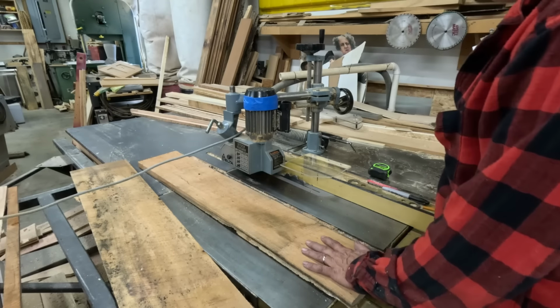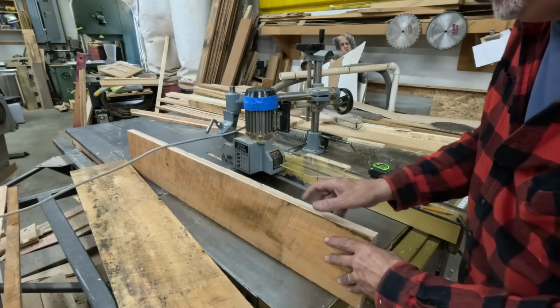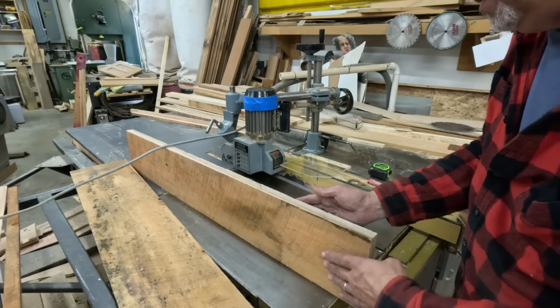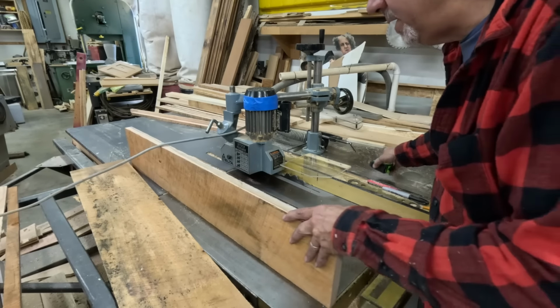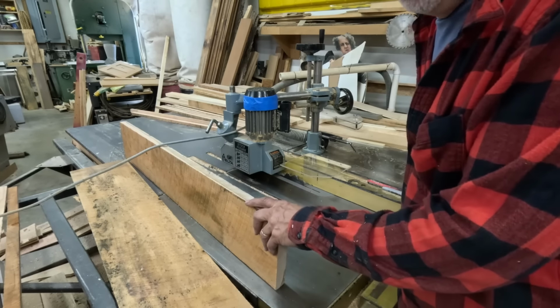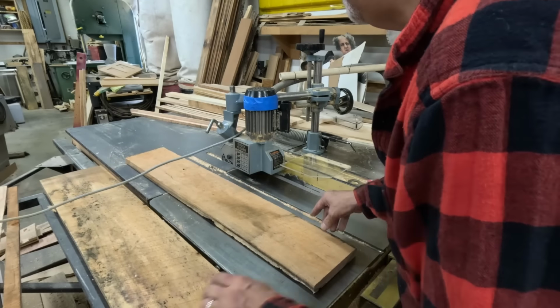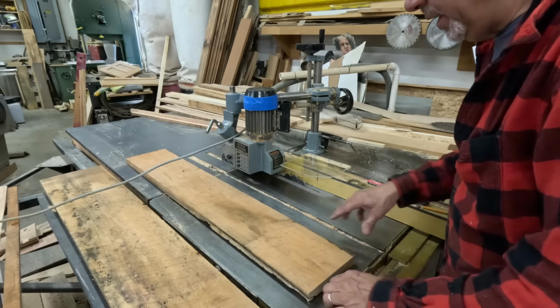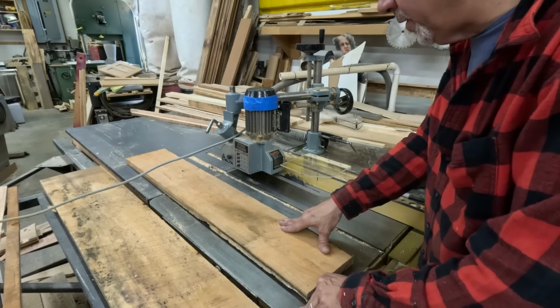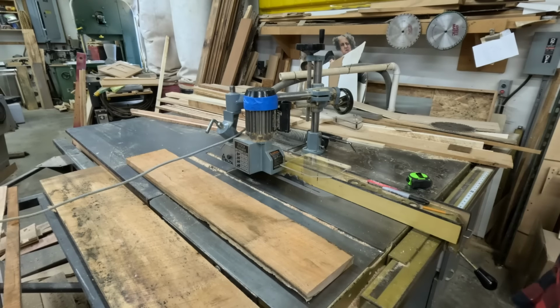So all we're going to do, in this set for 3/4 inch, I do not plane the board down to this thickness. Whatever comes off the saw, in our case, it's roughly 1 1/8 inches. And that's what we cut all of our 4/4 lumber. And people cannot grasp that for some reason. I don't know why. But if you're going to sell commercial hardwood and you're going to call it 4/4 and you're sawing it 1 inch, you will not have any buyers. They will not buy it.